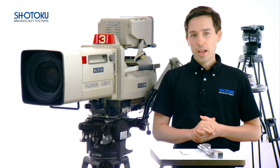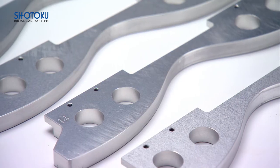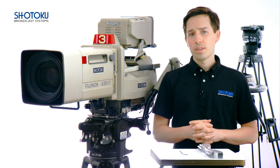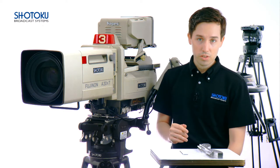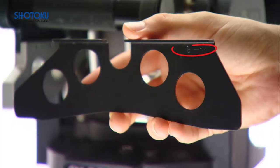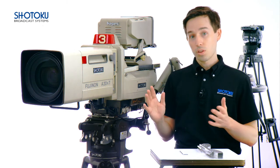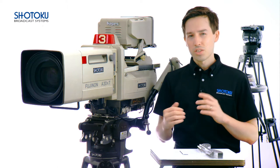Before demonstrating how to change cams, let's first understand the many types of cams available. Made of aluminum alloy, there are 15 cams made to suit kits with centers of gravity height between 6 centimeters and 20 centimeters above the platform. Remember, weight has nothing to do with the kind of cam that you use — it's all about the height of the center of gravity. It's also important to note that there are four brake plates, each corresponding to a range of cam sizes. When going from one range of cams to the next, we'll have to swap out the brake plate to ensure smooth performance.